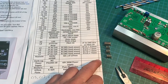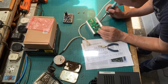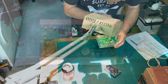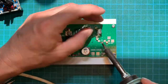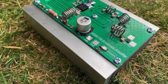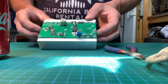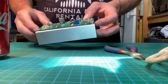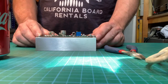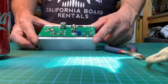So there we are, all four coils made. Let's get them on there. Right, so we've finished building our amplifier — a little bit tricky, definitely need a smaller soldering iron. We need to connect the RF input from our 1 watt transmitter and the output up to a power meter and dummy load. Also we need our power supply — this takes 48 volts and our transmitter runs at 12 to 15 volts. So let's get all that put together.